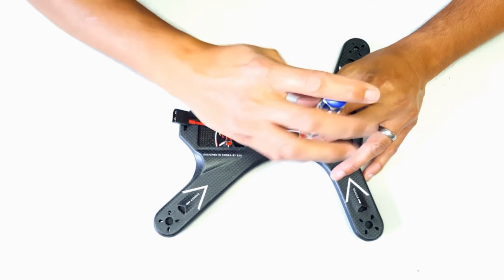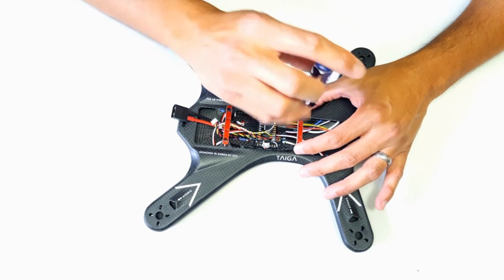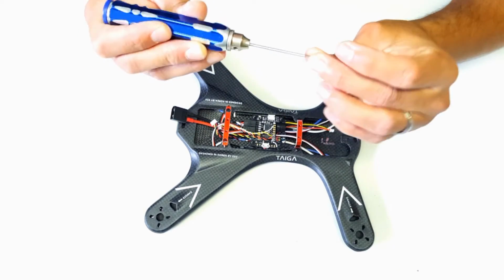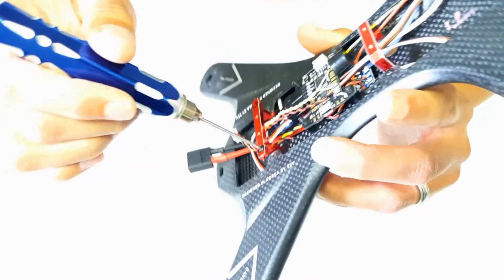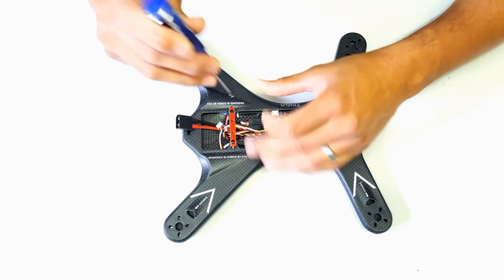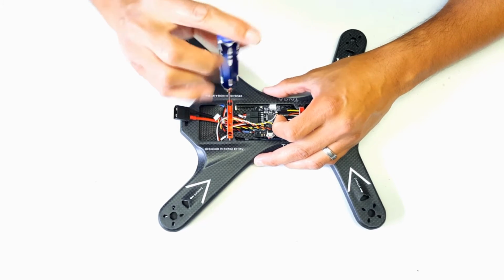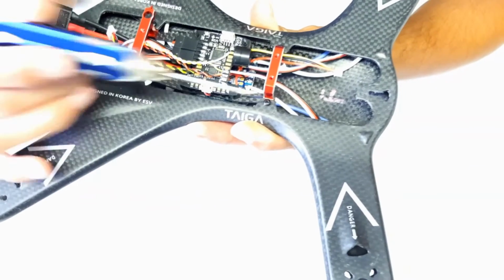And here, typically metal to metal, I'd be using Loctite. Again, the easiest way to do the back is to install the screw on your tool. You drop it down through the hole opening here. So to recap, the aluminum bridge fits underneath the carbon fiber tab at all 4 corners. Then you use 4 screws, 2 here up front and 2 in the back.